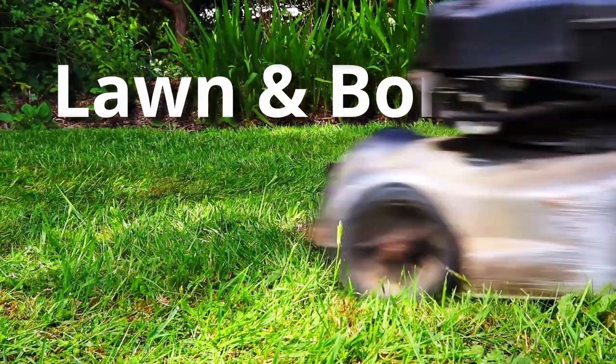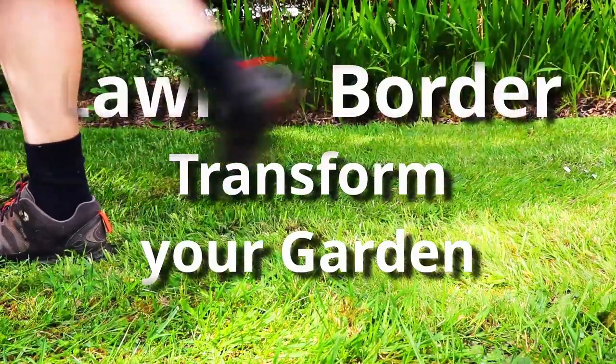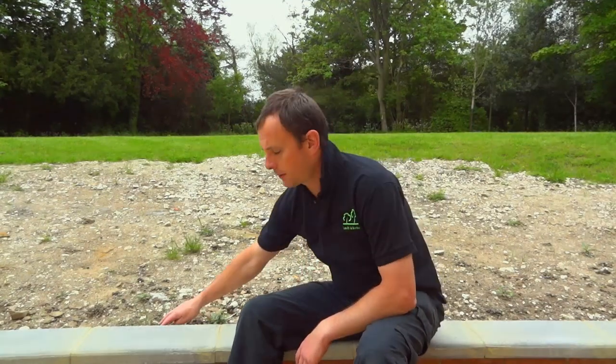This week we're going to be applying topsoil, topdressing, and seeding. You can see the existing grass — what we've got to do is level and smooth out the surface, take out all the bigger material, clear off all the bits of grass we don't want, clear off the big stones, and then tread it ready to prep for putting the soil on. Once the grading's been done I'll show you again, and then tomorrow we'll be able to show you the topsoil.